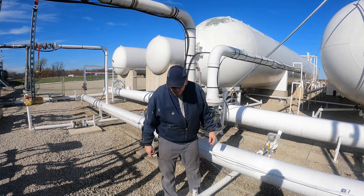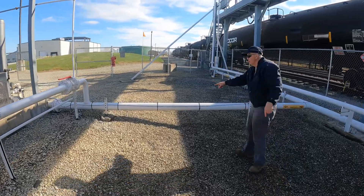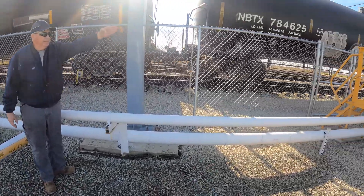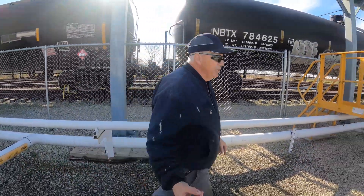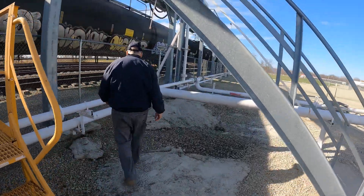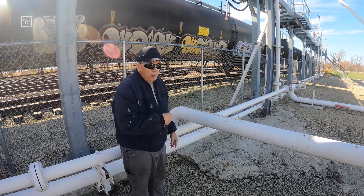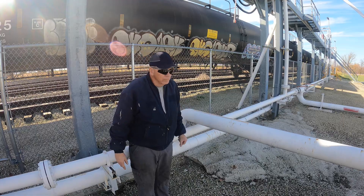As this vapor makes its way through the liquid, it'll condense and turn from vapor back into liquid in the bottom of the tanks, and I will not raise the pressure of my tanks at all. If you were to recover into the vapor space of the tank, you run a risk of really elevating tank pressure. These two compressors tie into this trunk line that runs the length of all four of my towers, reducing to four-inch pipe down the line. There are no back check valves on this vapor section — product can go back and forth either way, whether offloading or recovering.